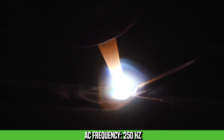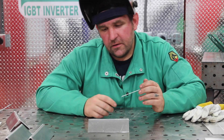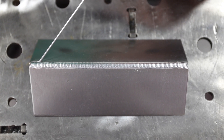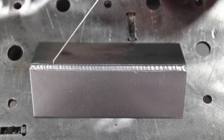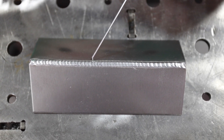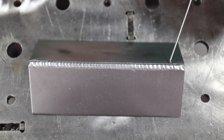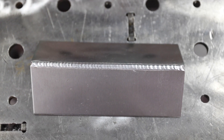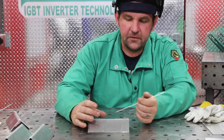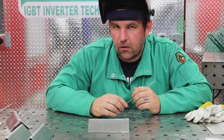For me, running a very high frequency can sometimes be a little harder due to the diminished heat input and how big of an effect that has as you go along the joint. We just got done making our pass at 250 hertz. I was trying to run all three of these at about the same amount of pedal, around 85–90 amps. At the start I was a little cold, I rolled into the pedal to around 90 amps, it got a little hot, then too hot, I backed out, and we got cold again. If you run a really high frequency like this, it can almost be harder to run than a lower frequency because your heat input is so concentrated that it heats up that spot quickly, and when you back off it cools that area really fast as well.